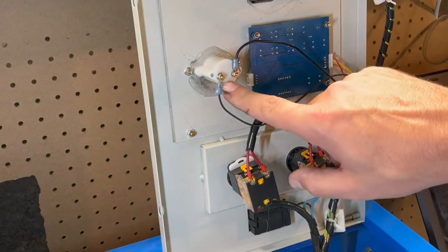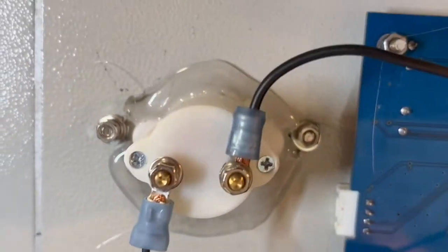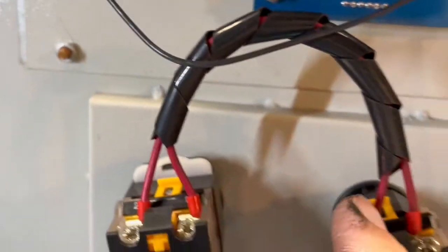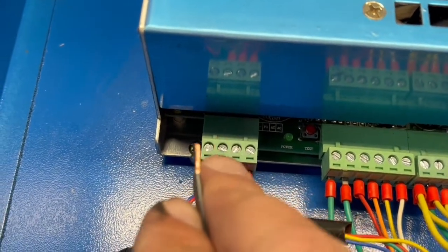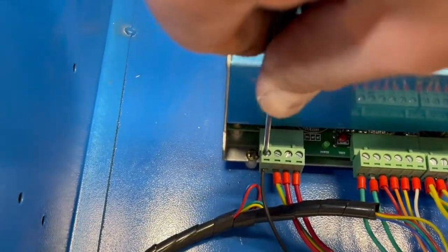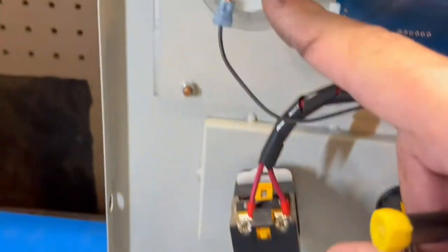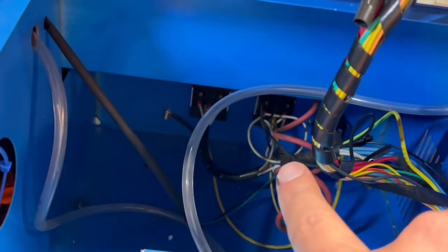This one right here is going back down to the control panel. There is one marked positive and one marked negative. The one marked negative goes back down into this control box — I don't have one of those fancy little red pin connectors, so we're just going to strip off a little bit of the wire and put it right back in that slot and tighten the screw down. That should give us a nice secure connection. Then this side, labeled as positive on the milliamp meter, goes all the way back down through and to the laser tube.